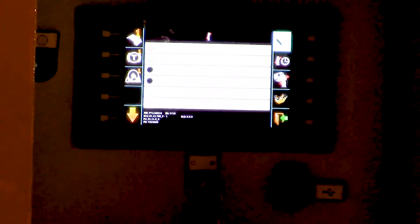Next down here is our diagnostics page. We can do lots of different things from this screen. If we have a multiple bull wheel machine we can switch the sides of the circuits. Each of these tells you which circuit is being used and if there are milliamps or millivolts and which solenoid is being used on that circuit. The next button down is our test port — we can test the machine against the negative brake, and at 50 hours that's actually a requirement that'll show up on the maintenance screen. We can also test the reel stand pressure to make sure that's pointed back where it's supposed to.